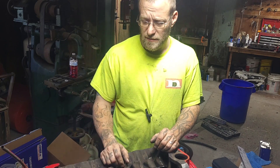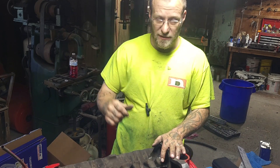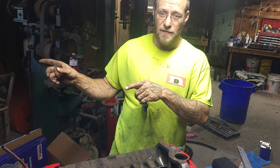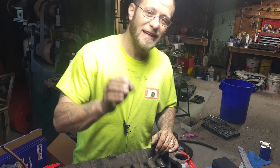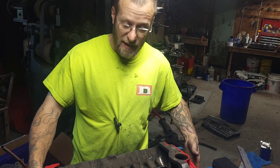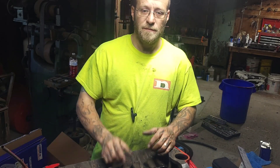I probably need to clean the paint off this top surface — I'll do that before I take it outside to paint it so we can get everything off. Once we clean it off for the final time, we use the air hose to blow everything out really well, and any machined surface — the deck, bores, inside the cam journals where the cam bearings ride — we're going to wipe down with WD-40 to make sure she doesn't flash rust on us.